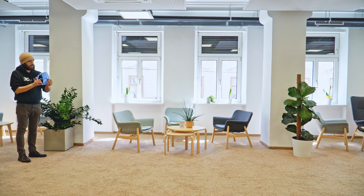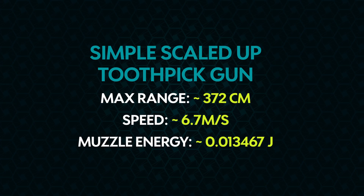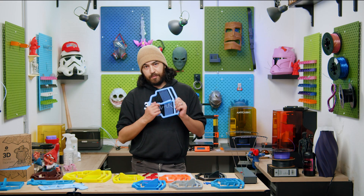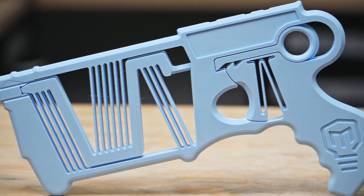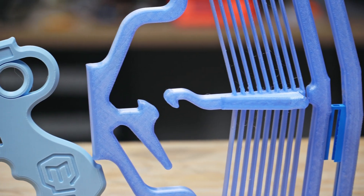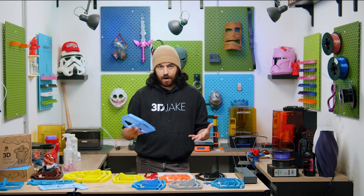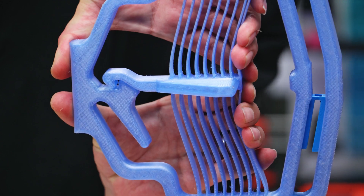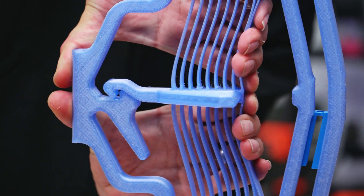The simplest idea works — to a point. That was kind of crap. It was pretty much the same as the others. So it's an improvement on our tiny toothpick gun, but there's one big problem. Look at the difference in size of the springs: this one is 50 millimeters and this one is 90 millimeters, and our scaled-up toothpick gun has the same range as the others. Clearly it's not just about how big the springs are. I think this many ribs are holding us back — we're only bending them, not stretching them. And if I pull more, I have a bit more space where the trigger catches the spring, so I can redesign it for maximum draw.